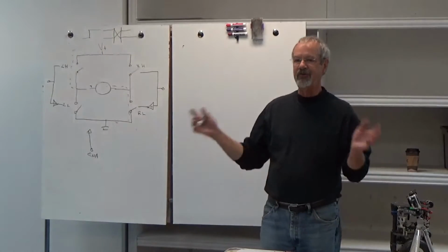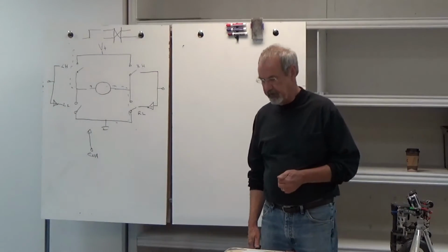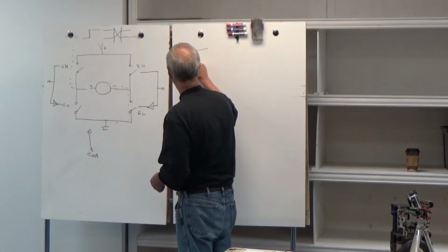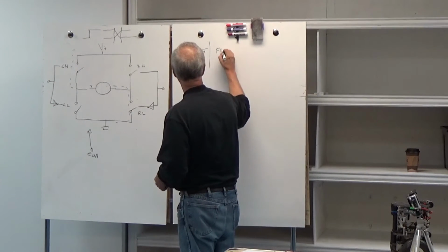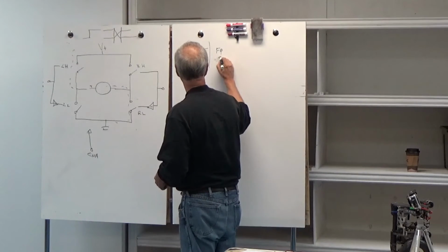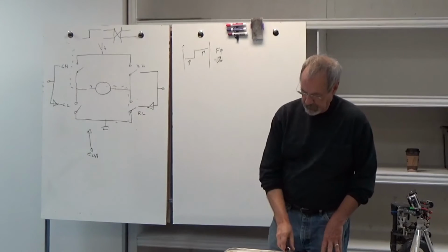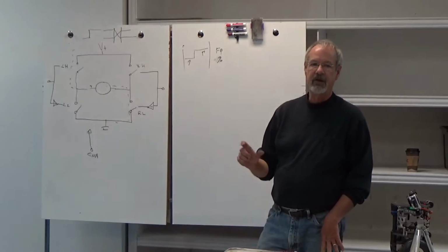So we're going to assume that you're trying to build one of those, and you need to know how it works. Essentially, depending on how your hardware is set up, either you tell it a low time and a high time, or you tell it a frequency and a pulse width, or a duty cycle, I should say. That's an easier way to specify it. So in both cases, essentially we have a duty cycle and we have a frequency.